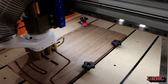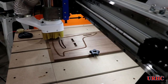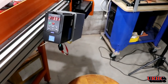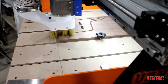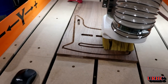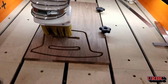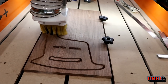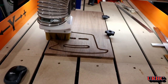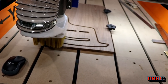It is going to be a very handy machine for projects like this. I was really excited that everything went well on this first run. The spindle is working great — I've got it set at 14,000 RPM. Masso sets the speed, waits for it to wind up, and all that seems to be working good. All that extra dust collection really did help — no dust at all on the table. You can see that piece of scrap walnut, I was able to get some nice half-inch thick stock out of it, and I've got a ton more of that to use up.